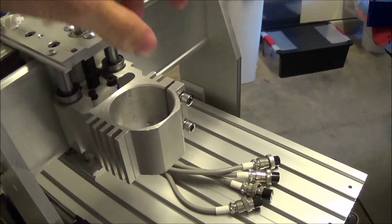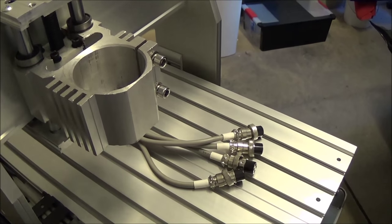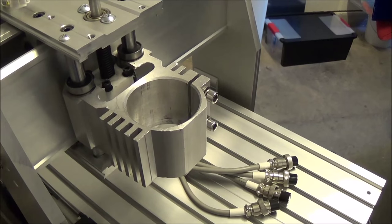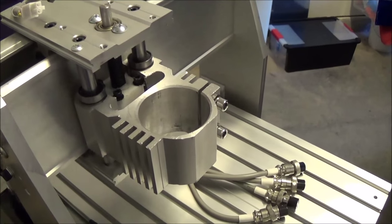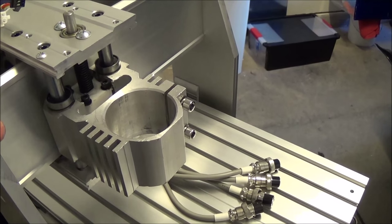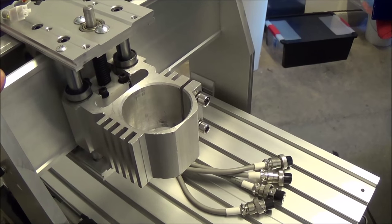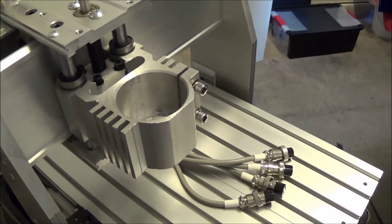And then the spindle just mounts in this bore, which is clamped. And right on the spindle body, I don't have it here, but maybe in a later video I'll show you. But it's actually a really crappy design, because this clamp crushes the motor, and there's nothing in there except a steel body. So in my opinion, it's just pretty much a terrible design. But again, what do you get for $500? And I'm going to say probably not much. But all in all, it's a decent platform.